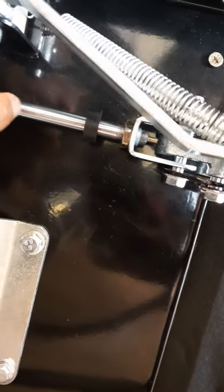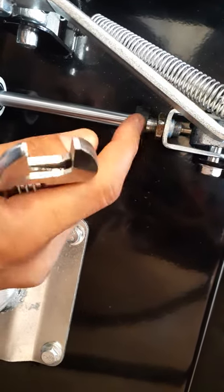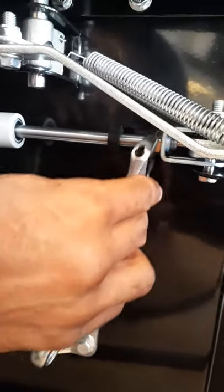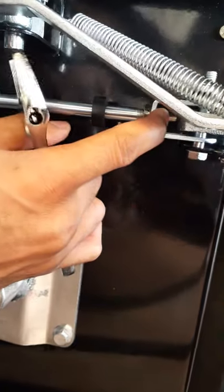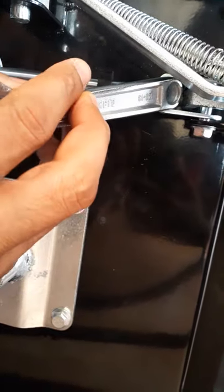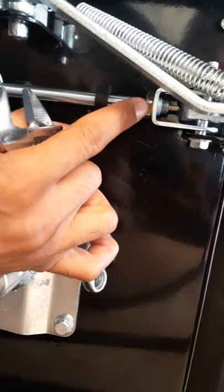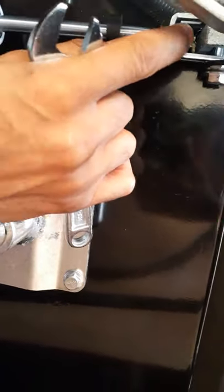Make sure as you loosen it that you're also loosening this pole, because this pole has to come backwards a little bit to give this pin some space. Once you see there's some space in between this and this, re-tighten it. Don't just leave it loose — you have to re-tighten this and make sure it's very snug. This will stop your problem of your barber chair reclining when you have not pressed the lever. It is this pin hitting up against here that's causing it. You have to create space, loosen the screw, make sure this pole comes back some, and then re-tighten it so there's space in between.